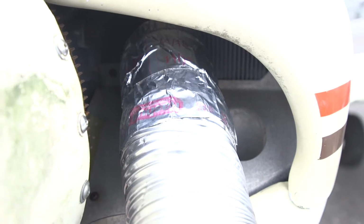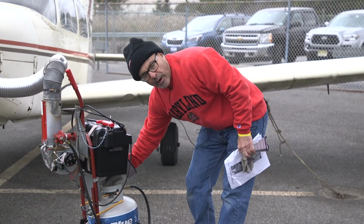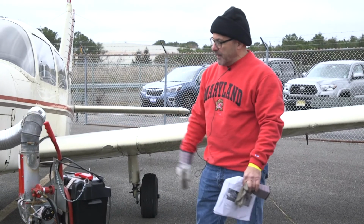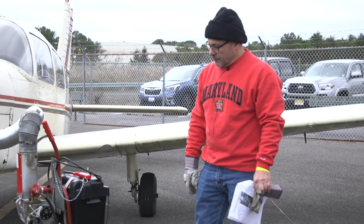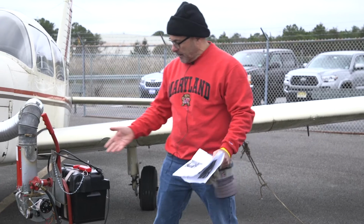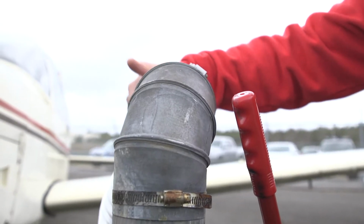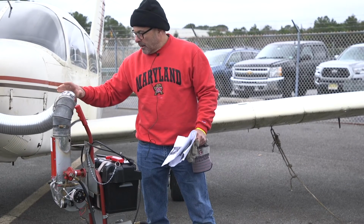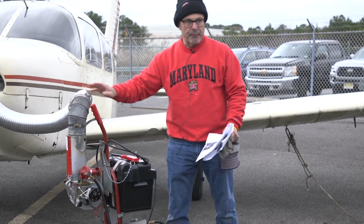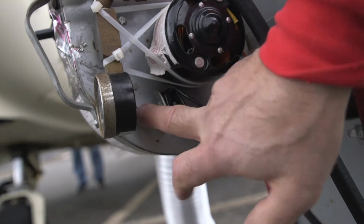And then in order to turn it off, you turn it off at the gas source, full clockwise. It'll run a little while longer as it burns up the excess gas. Flame is out, but let it run longer now to cool down. The blower will cool it down in here. This is typically the hottest area where the flame's coming right up. That's why they're steel. And you should be able to comfortably touch any of these areas before shutting off the gas. Last thing you do, blower switch off.